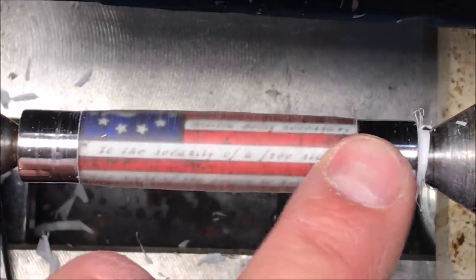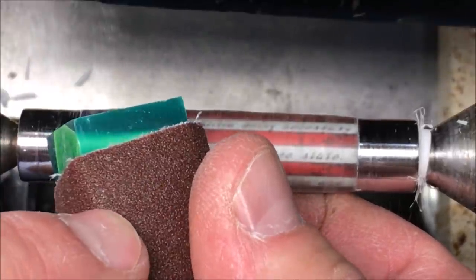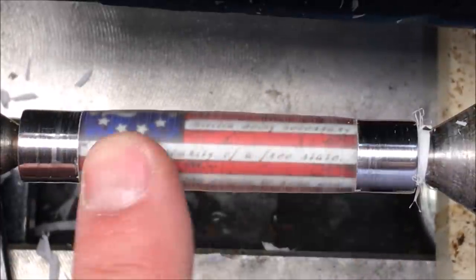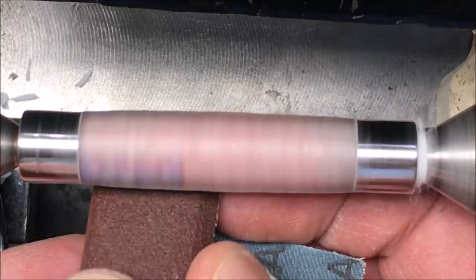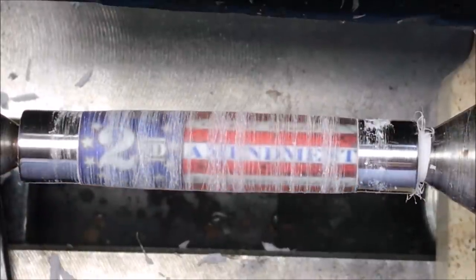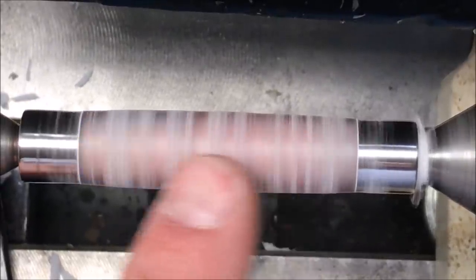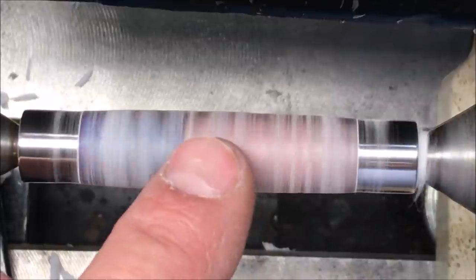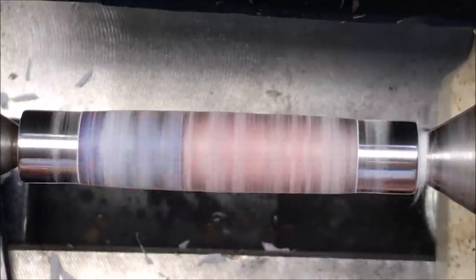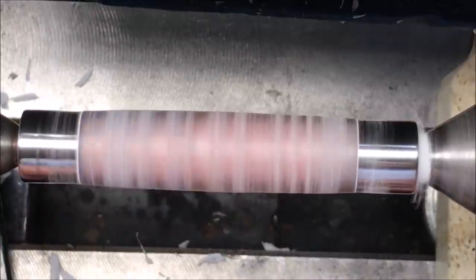This will enable us to get a glass smooth finish from end to end. We only need to use the acrylic blank with the 150 grit paper. Once we get past the 150, we can sand normally, because as soon as you get done, you will not feel any tool marks in your blank. I've only made a couple of passes, and notice how you have the real scratched up areas and the somewhat shiny areas. The scratchy areas are the high areas. The shiny areas are the low areas. By using this blank and the paper in this method, we're going to take that down toward the entire blank, and this is how you know it's perfect. When the entire blank is scuffed, you can stop sanding.